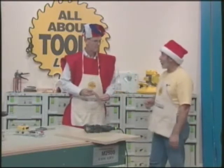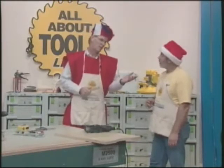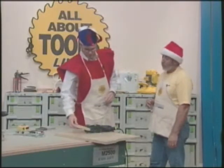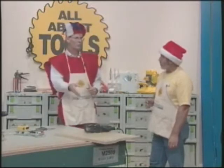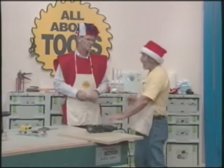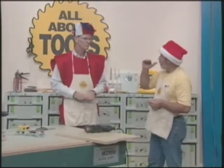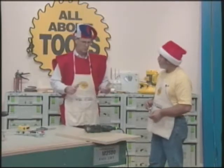That's my understanding. So anybody that does laminate work, the same thing applies to solid surface, although you have to be concerned about leaving the scoring line in the side wall of the material. At least you're not worried about pulling chips out if you're using the chip guard. Now, in solid surface, a lot of guys do use jigsaws, but you've got to stay well away from your cut because it actually can cause horizontal fractures, correct? Correct. It causes what's called a stress riser.